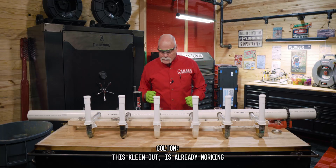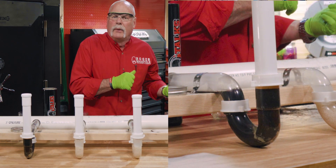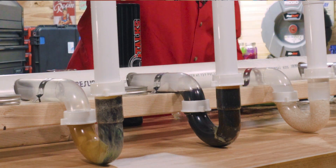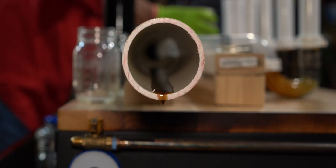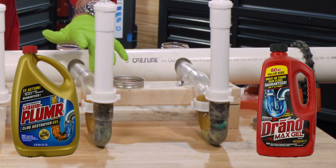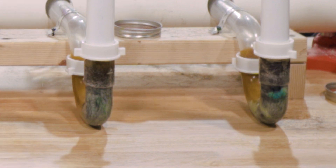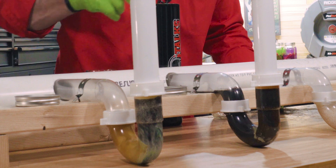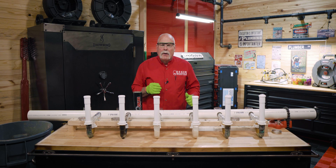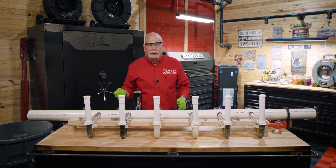12 seconds later, this Cleanout's already working — there's stuff dripping outside. Very interesting. I'm glad we hung around because we were literally going to walk away. This one, the Cleanout, has already eaten through. It's gone up through the trap, through the clog, and is actually starting to drip out the end. I don't see the Drano has moved at all. I don't see the Liquid Plumber has really moved at all, maybe a little bit on the Drano. The Cleanout has gone all the way through it and it's doing pretty good. I really think if there was water in here it would push it out. We'll come back in about an hour and see if any of them have gone down enough to pour eight ounces of water to flush it through.